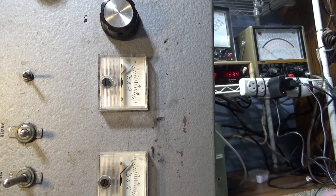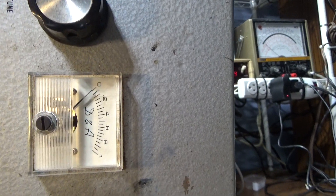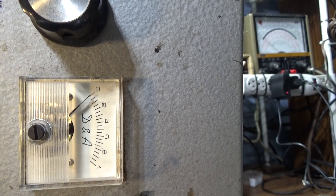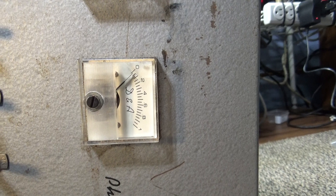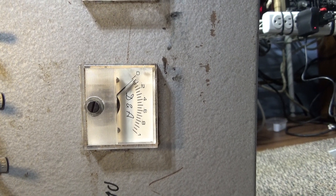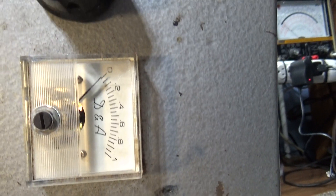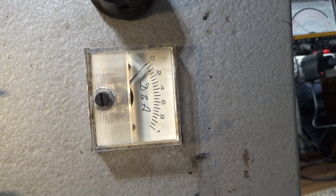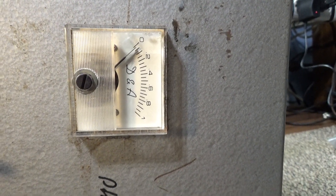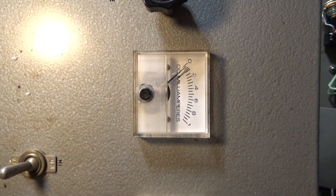It's interesting how they got the two meters set up. One panel meter goes to the output of the final tubes. On the low side, you're just running the driver tubes and bypassing the final tubes, so since that meter is connected to the final tubes it wouldn't be in effect when you're running the driver tubes — that's how they got the second meter configured. Depending on high or low on that meter with the driver tubes, and I think it's the same way with this DNA Warrior.